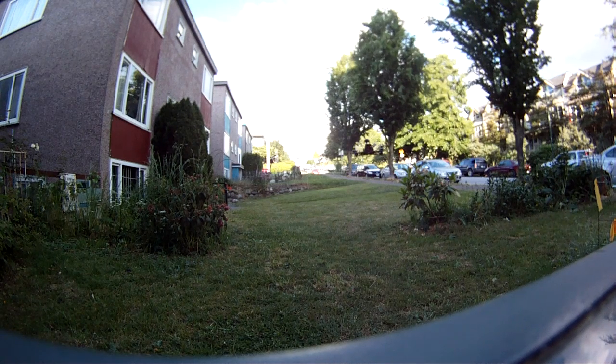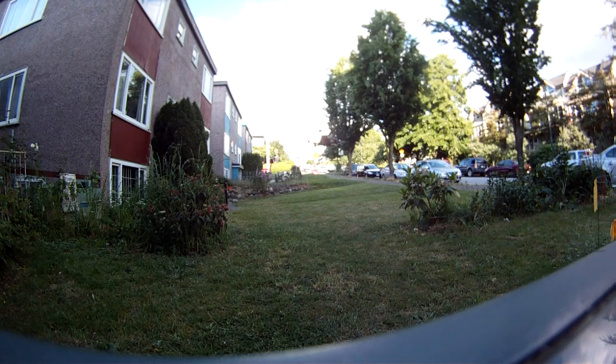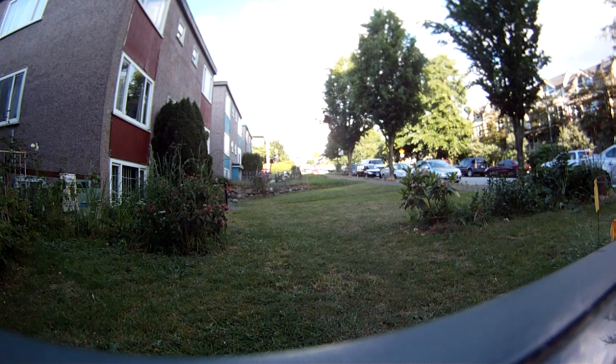Well, quad number 2 is ready for action. I just have to fix my Mobius or get a GoPro 4, I guess. These are 2206 motors that can definitely carry a GoPro. These are 2000 kV, so I can put 6-inch props on them.